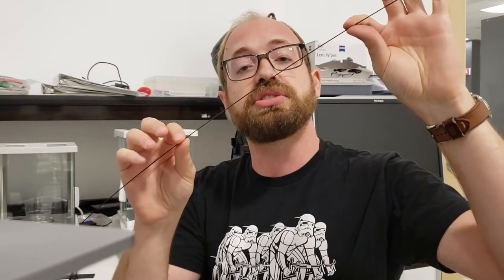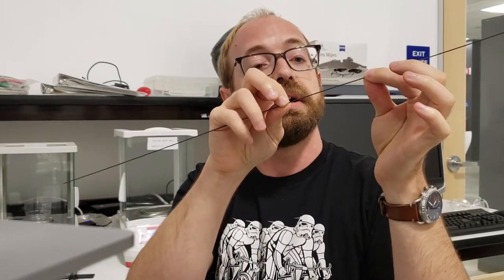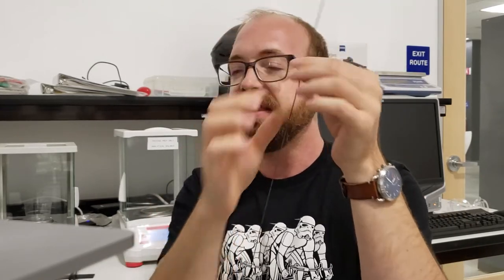Contrast that with this filament, which is what we make our composite structures out of. It's incredibly strong in tension and very strong in compression as well. Strength-to-weight compared to many other materials, it still comes out on top. But it's fiber-dominated when I pull or push on the filament — if I were to try to split this filament in half, I'm mostly pulling on plastic, on the other part of the composite. So it's plastic-like strength in some directions, carbon-like strength in other directions, and a mix in others — and that's why composites are complicated, and why you need fancy software and talented engineers to figure it out.